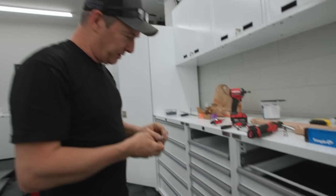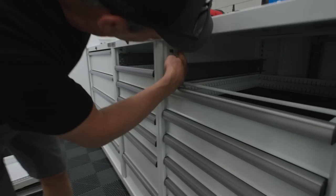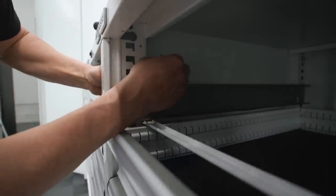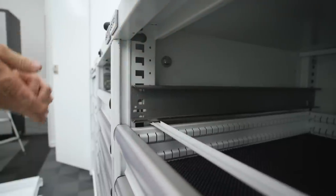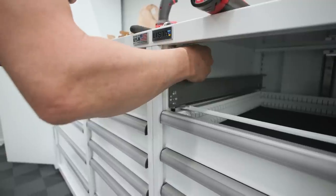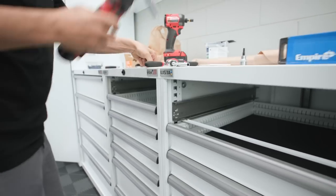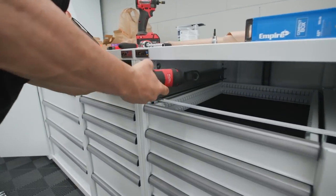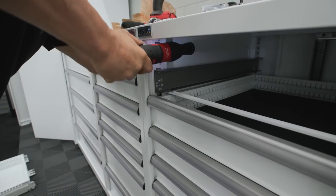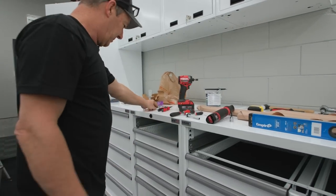The last bolt to go in this section is the top bolt, so you have to remove the drawers. You can see there's a hole through it that lines up with the other cabinet. I'm using a three-eighths bolt - it's a little over a thirty-second over three-eighths hole. Three-eighths bolt, nut, washers. Sucked them up nice and tight.